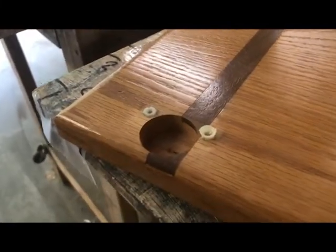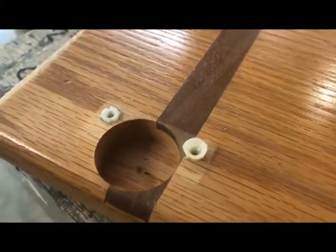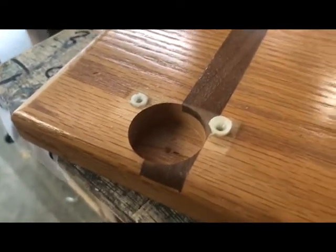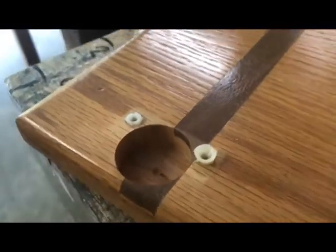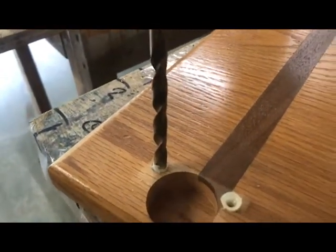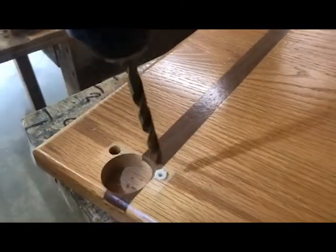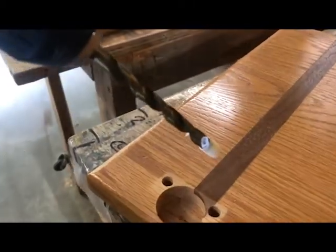These doors have little plastic inserts for holding the screws that held the hinges on, and they don't come out with a pair of pliers. They have this little extra cone piece that sticks up, which just pops right off and leaves a short stub you can't grip with pliers. So I'm going to take a drill bit that's just a little bit smaller than the insert hole and drill these out.